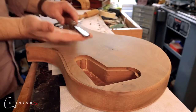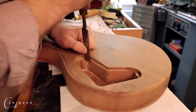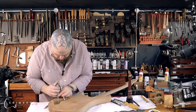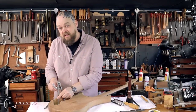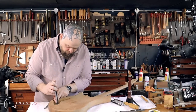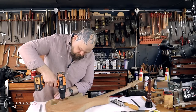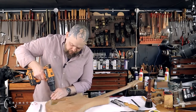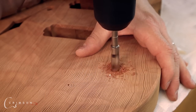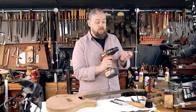That's just a round over. Inside ground gouge — the bevel's on the inside of the curve, very very useful. Switches and controls: even when they're not in a straight line you want them to be at the same distance apart if at all possible. We drill through with a small bit from this side — it might be a little bit of tear out. The switch needs a 12 millimeter hole.